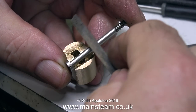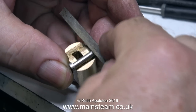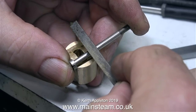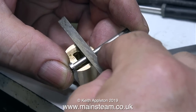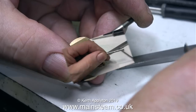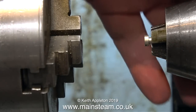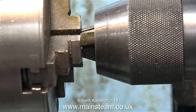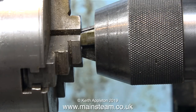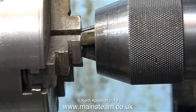I found in my box of long 4BA bolts something I thought would be OK to make the cross pin. But unfortunately when I used the needle file to mark where the thread's going to be, I realised that what I thought was a steel bolt is really made from brass — it's so well plated it had me fooled for a moment. I'll still go through the process of making a pin, because this is something you have to do quite a lot if you work with steam engines.